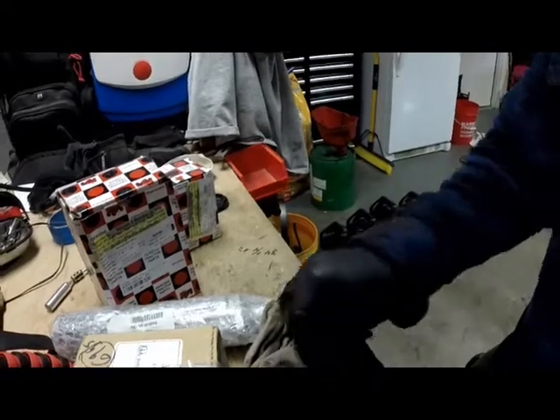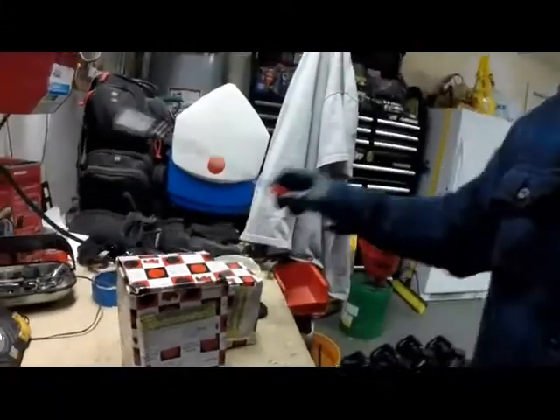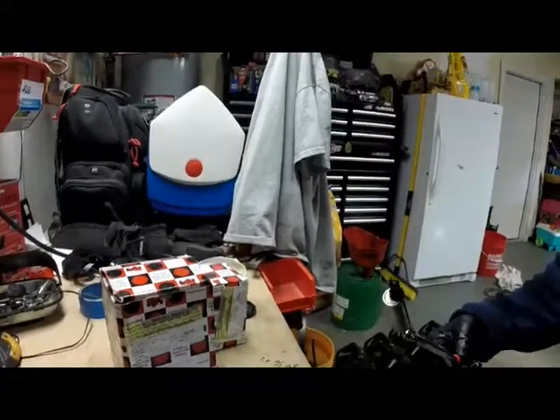This is probably just break-in material. We could take this to a lab and find out exactly where the shavings are coming from, but that's not our concern right now. All we need to care about is getting the fluid changed and getting these filters in there. Be aware that on your first change, it is super important to get these done — changing these filters and doing these services. Because if it accumulates too much, the magnet won't pick it up anymore and it'll run through your whole system and totally trash your tractor. So for longevity, make sure you keep up with your maintenance.